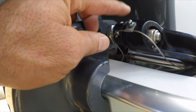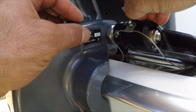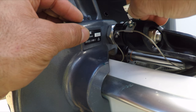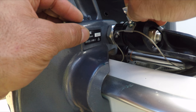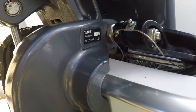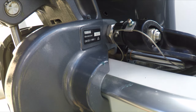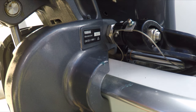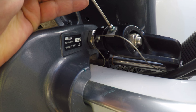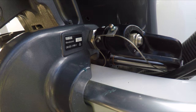In this case it looks like there's rust right inside the port here, so the grease has not been able to go in — it's like sealed. It looks like this pin is completely shut. So what I'm going to do is get a small screwdriver and a hammer and just tap it gently. As you can see, the port is now open.